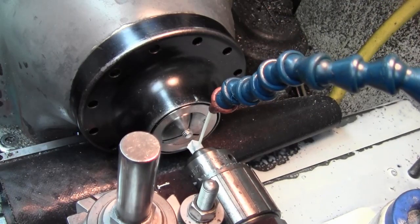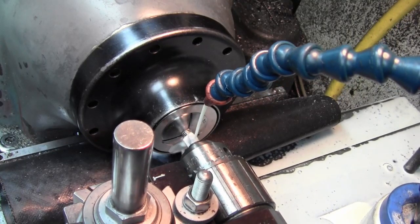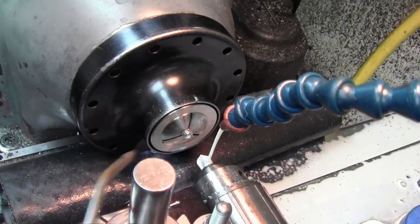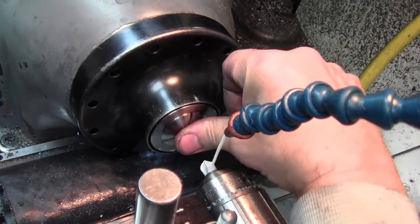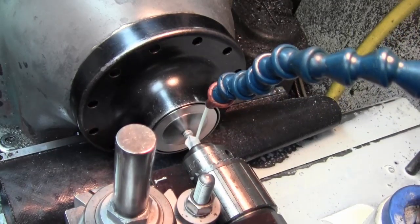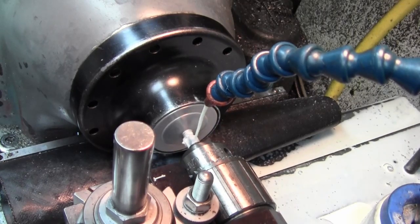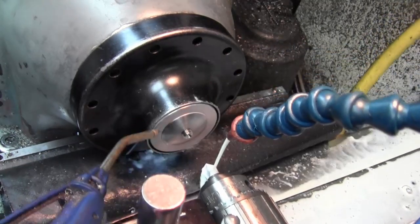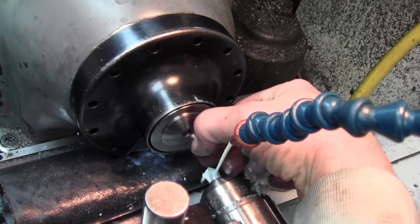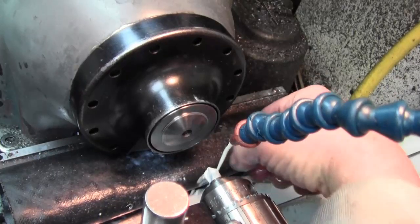And now I have a spotting drill in the chuck. I've come in and set it so that I have a little over 3/16 diameter to chamfer the threads. And I'm gonna actually hit these on both ends now. Just flip, take it out. Come in here. Go to my zero. Another rinse repeat on these.